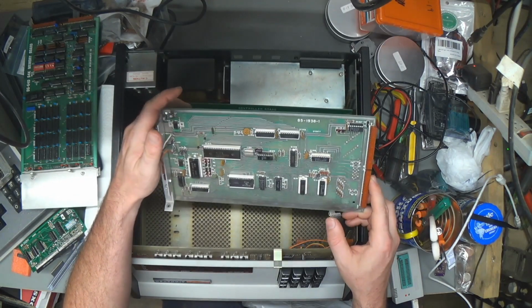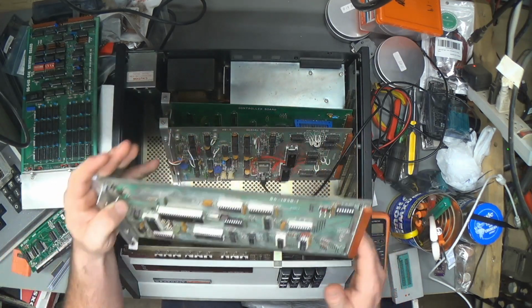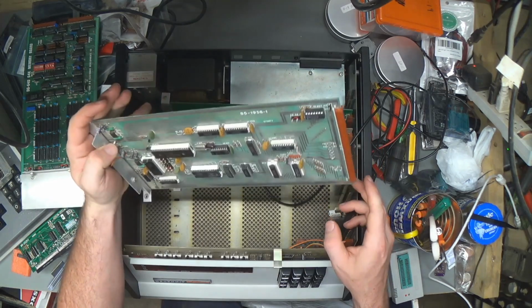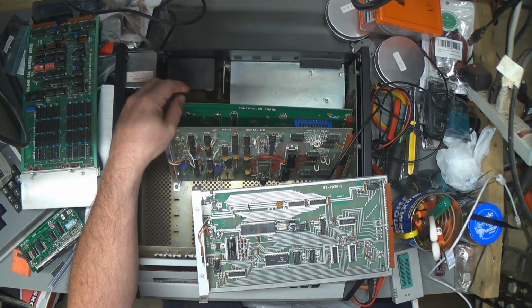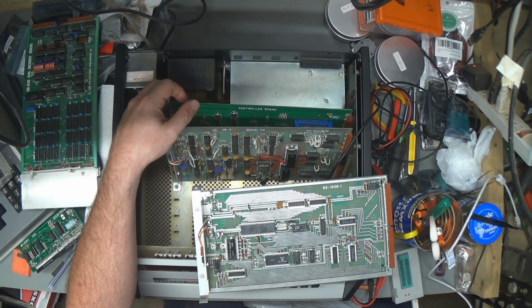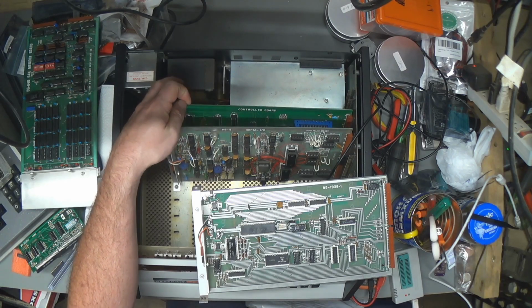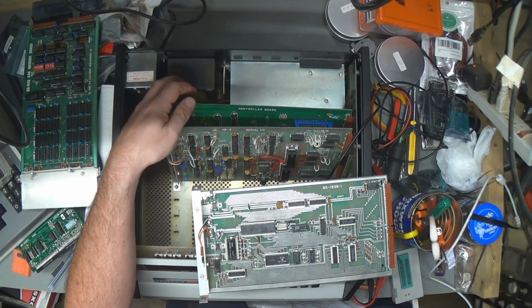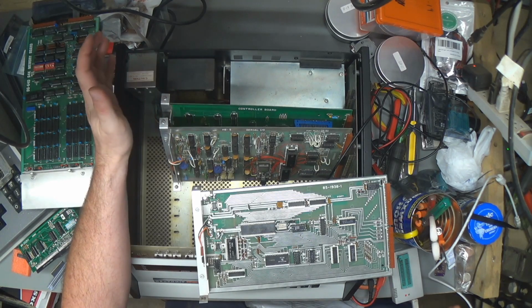And I fired it all up with the 64K homemade memory card in there, and both the normal RAM tests and the controller board's couple of 2114s tested fine. I think they're 4K by 4 SRAMs. I may be wrong on that, so double check if you have to. But they tested fine too, so my assumption is that everything is working as it should.